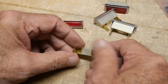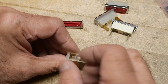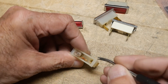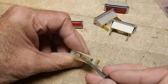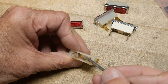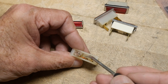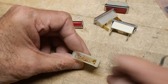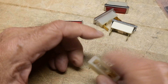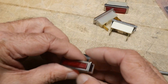These things do not require any external circuitry — they have built-in circuitry to drive the plasma display. If we move the plasma tube over, we can see a device down here that allows the correct current to be driven by the tube. These are pretty fancy devices and they have a color code on them: orange, black, orange. The plasma tube and the driver are a matched pair — you have to have one matched to the other for these things to function correctly.